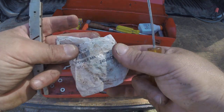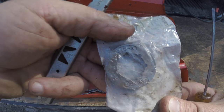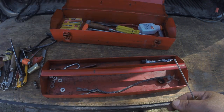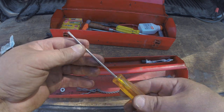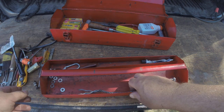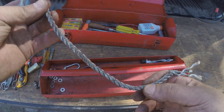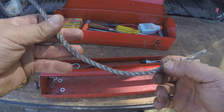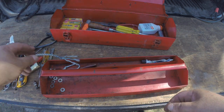Electric tape. Spare sprocket — and that is for a Stihl. Another one of these, another one of these. If you ever got to change your sprocket on a Husky, that's a real pain. Got to take out the spark plug, jam this rope in — you know the deal.